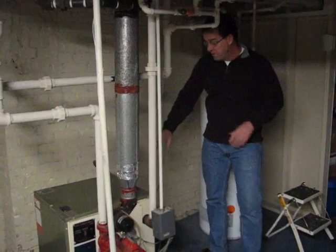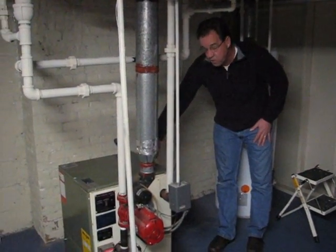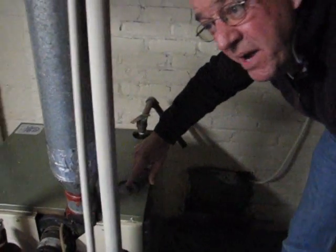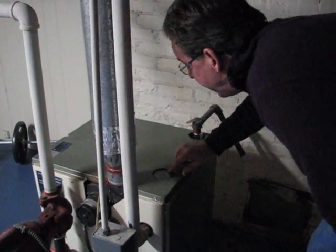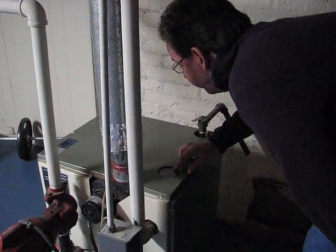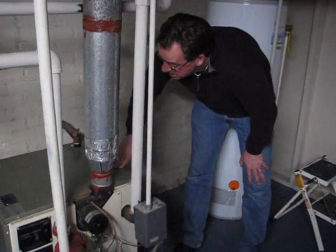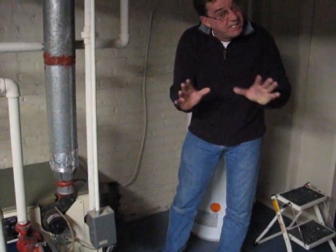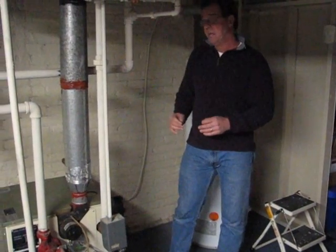You can do this at home. On your boiler, you've got two settings, two readings. One is the temperature and one is the pressure. When you look at the temperature, you want it right in about the 120-degree range — it's about 118 according to that. The second thing you want to look at is the pressure, the PSIs. Right now it's at 20. If it starts pushing on 30, you probably should have someone come in and take a look at it.